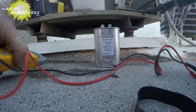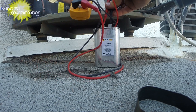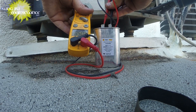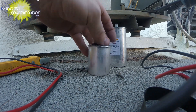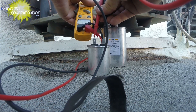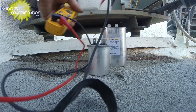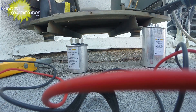We're going with these Titan Pros — those have been so far much better. The substandard capacitors were just going out too soon on me. I found I can get multi-packs of these. It's a 35 and a 5 — a little different shape, but I ordered the wrong one pack in it. They'll work good for these. I'll save the other size ones for indoor blower motors as it's more critical.